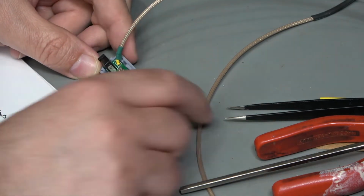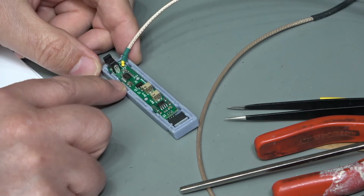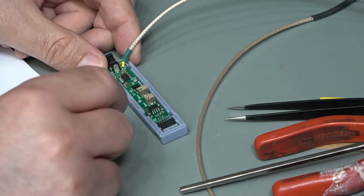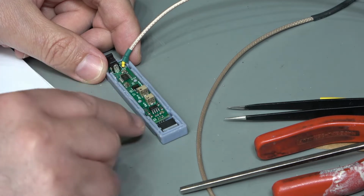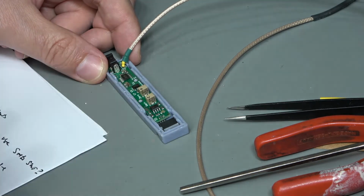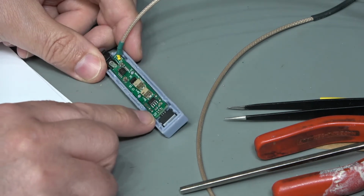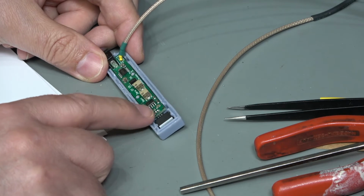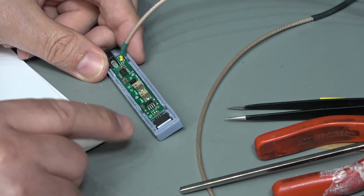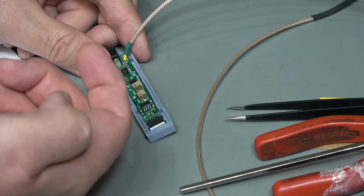We could do with just a teensy bit more clearance for the PCB in the case because of the leftover edges from the routing, where they've kept the boards together as they've manufactured them. The little sticky outy bits are getting in the way of the case. We also need a spacer jig for the sensor. Two points for that: one, so we get the bend in the right place, and secondly, so it'll actually space it off the board.